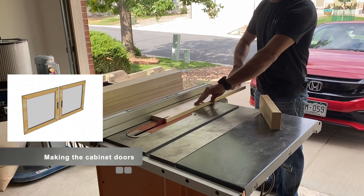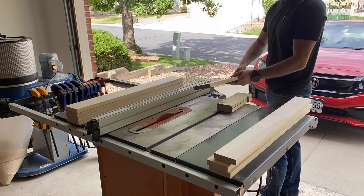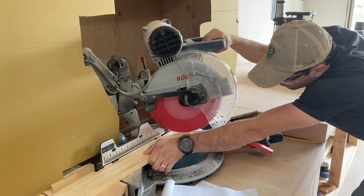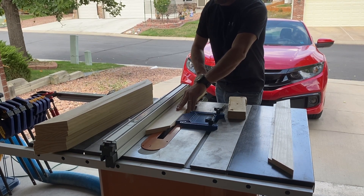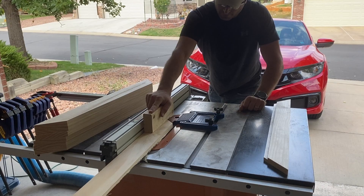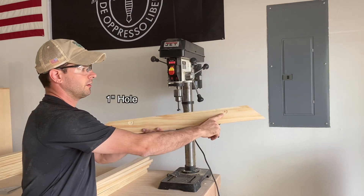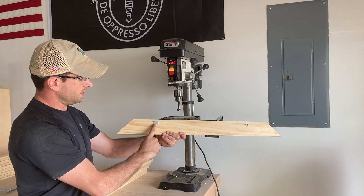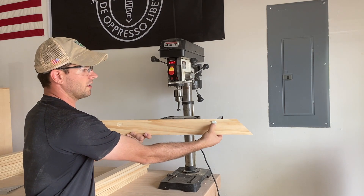The next step is to make all the cabinet doors for the support benches. I'm going to put the polycarbonate in place in the bottom of the cabinet doors. I'm drilling a 1-inch hole with a Forstner bit, 1/16th of an inch deep, and that will hold this washer in a little recess right there. It's even got a little pilot hole for the screw. I'll put these 1-inch washers in these little recesses and then screw them in, and that will hold the polycarbonate in place.